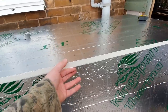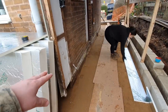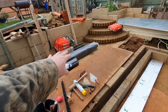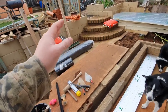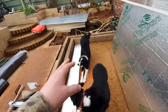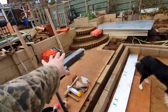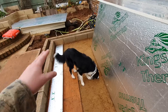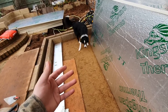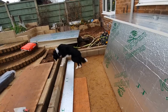I've got some more of this 25mm insulation for the upstands to cut. Once that's done, we're going to cut all of the large sheets, fit them in like a jigsaw and number the pieces, and then take them all back out again. The reason we're doing this is we've got all this damp proof membrane to go in underneath, but we're not getting an inspection from the building inspector until Monday - five days from today. If we put that DPM down now and we had rain over the weekend, all of this insulation would be sat basically at the bottom of a pond, because that's practically a pond liner. So it's free draining as it is, and we'll just get everything cut and then as soon as the building inspector confirms he's coming, we can put it all in.